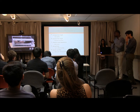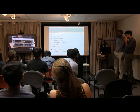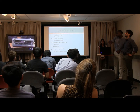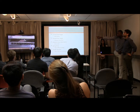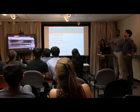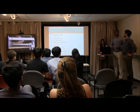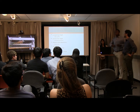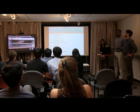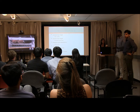That's actually kind of getting ahead of ourselves, but if you see at the top where the plate goes up, so Shihab, go ahead and lift the plate, and then you can see at the top there are these two kind of square things that come out from the side. So if Shihab were to push the handle forward, the plate would drop, but then the force that he has to hold the plate there would also push the handlebar down if those two stops weren't there. So that wasn't there before, but through building the prototype, we were able to see that that was an issue, and subsequently added that, thanks to Sandra, actually.